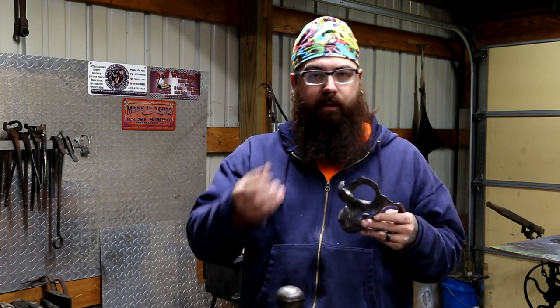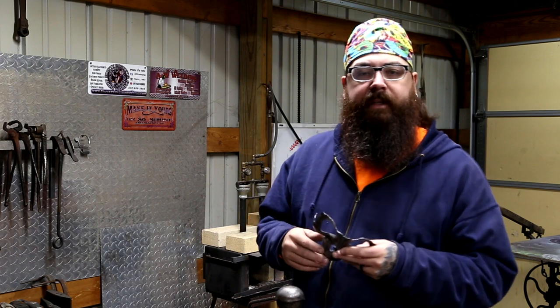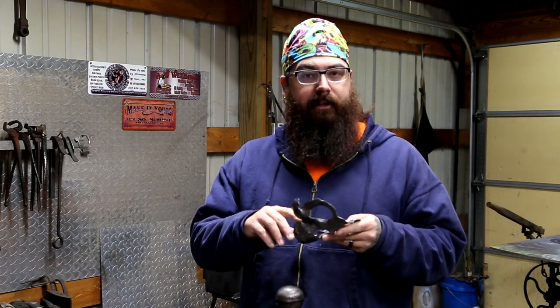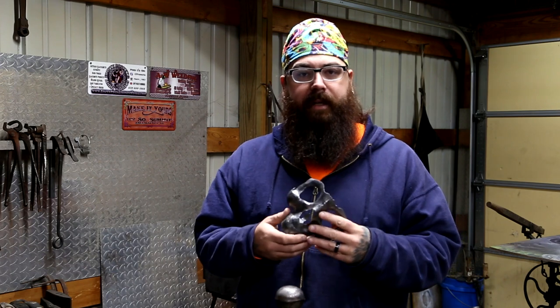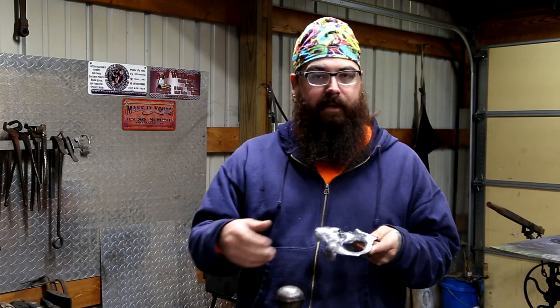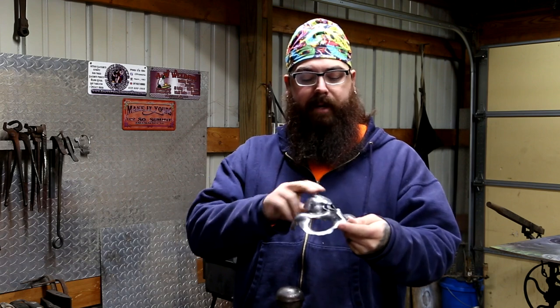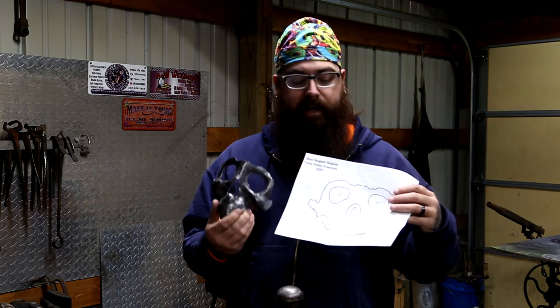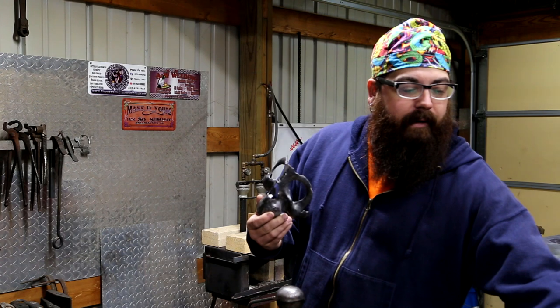For a skull helmet, you don't want anything protruding inward, anything that can potentially harm the individual that's wearing it. So for this, I actually ground those off. But they did prove to work, they shaped nicely, and I actually left them on during the forging process, which you've seen, so that it helped shape the upper mandible and face part. So yes, very happy with that. I feel very confident in putting that out there.